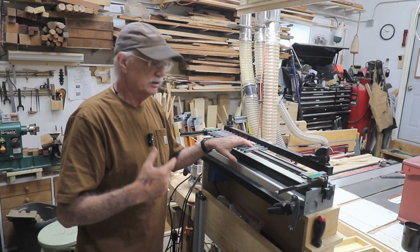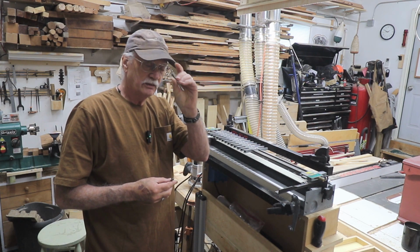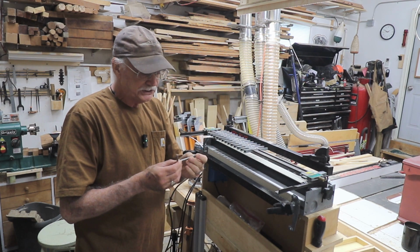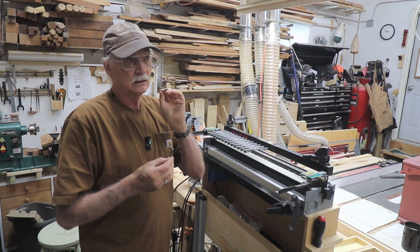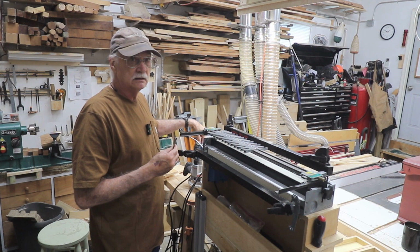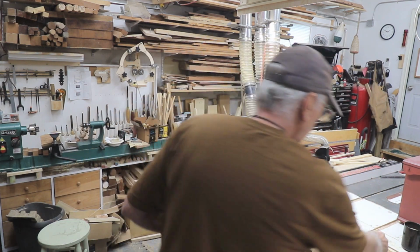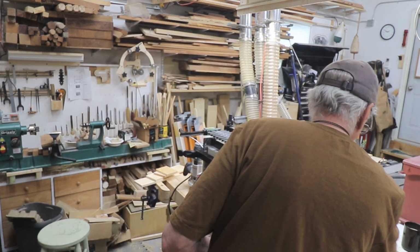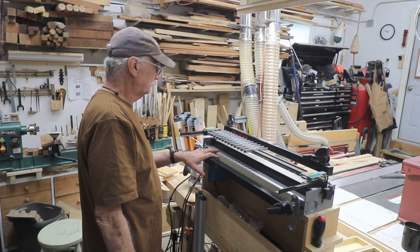So the first thing we need to do is set up the jig for the pattern that I want for my dovetails. Now the dovetails are cut with the number 80 dovetail bit. This is their number 80 or number 88. The 88 is metric in the shaft, and the 80 is SAE English in the shaft. I've got their collet in here to grab this, so this is the metric shaft. Oh, here's another one I've got. This one's metal, actually. This is a better one. I'll see if I can find out where I got these, and I'll put it in the description. So let me bring the camera over the top, and I'll show you what I need to do to get this set up.